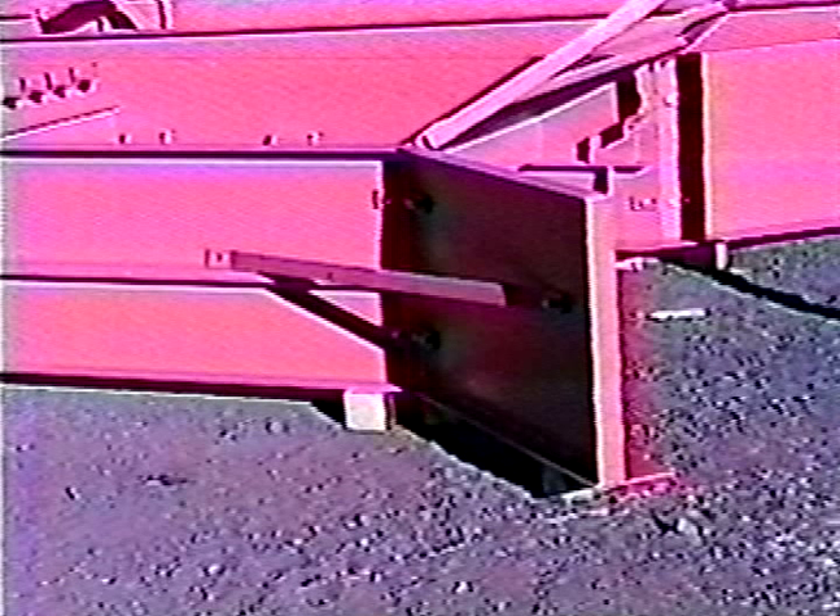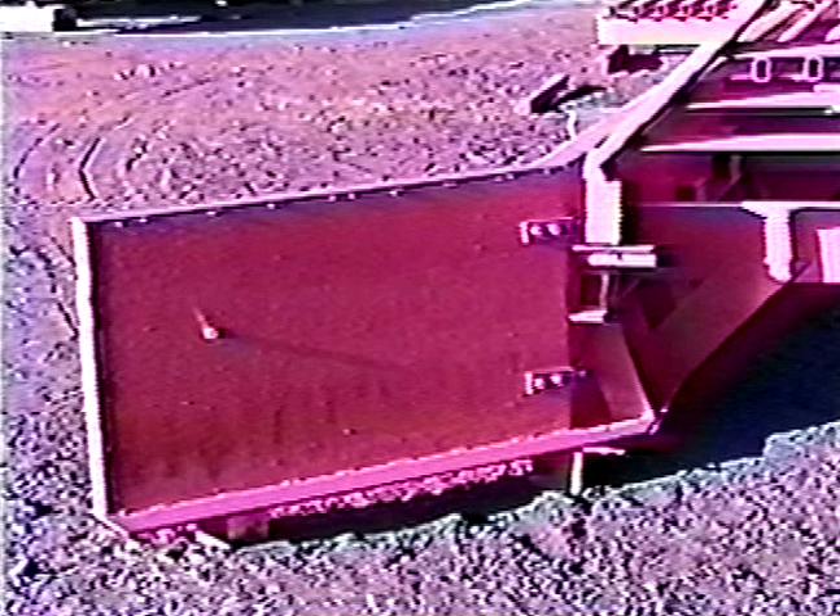On the backside of the inlet wing there is a brace to support the wing during compaction of the road. These inlet wings have two main purposes: first, to get the water freely under the road; second, to support the roadbed surface up to the cattle guard. The approach to the all-steel cattle guard is complete and it takes away the traffic hazard.